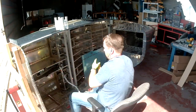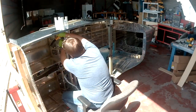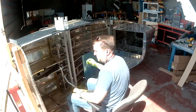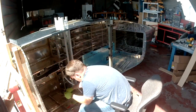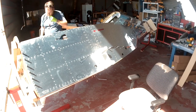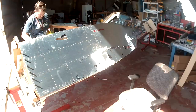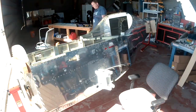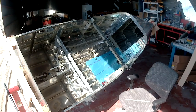Let me tell you, getting these things in is interesting. There are a couple of places where bolts get in the way — bolts of the ribs to the wing box. Vans says you can take them out wherever you need to and put them back in later, but I don't want to deal with re-torquing bolts more than once. So instead, I took an old piece of trailing edge material from the elevator or ailerons, drilled a hole in a tiny corner of it, and used that as a shim. Put your pop rivet in place, put this shim on over the mandrel, then put the pop rivet gun over it — it puts a nice big spacer in between. As long as the pop rivet gun can grip the mandrel, you can make a spacer as big as you want.